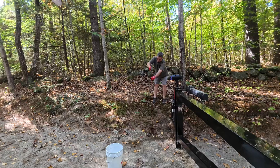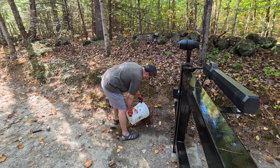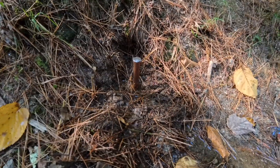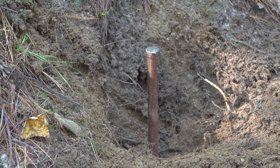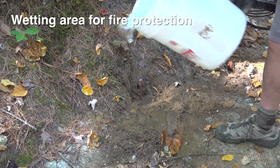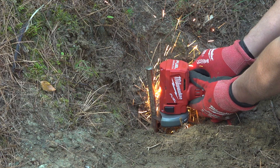Just let out your frustration and keep hammering that spike into the ground. If you get tired, just take a break — it doesn't make any difference. You can start one day and finish another; nothing in the rod is going to go bad. With a bunch of hammering my wrist was getting sore, but I kept at it. Finally, I got this thing down to the ground with about six inches of the rod remaining. In my experience, you're far better off burying your grounding rod because it protects the end from damage. Don't panic about the damaged mushroomed-out end — it's not a problem. Just grab a hacksaw or a power saw, cut past the mushroom, and now you've got a normal-size rod.